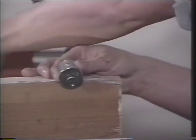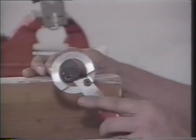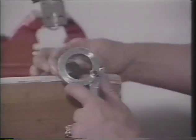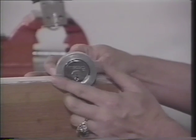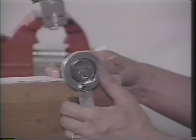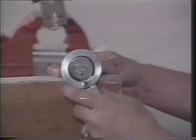Open the lock with a screwdriver. If you can get access to the lock, you can buy a $15 cylinder wrench which fits over the lock. And as you apply pressure, it adjusts itself to the lock, allowing you to turn it and rip it out of the jam. This is usually impossible if the lock has a guard ring around it, preventing entry.